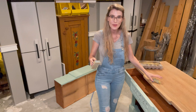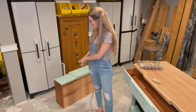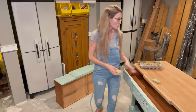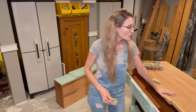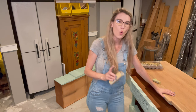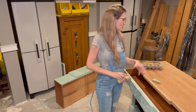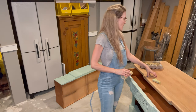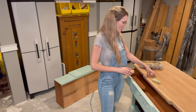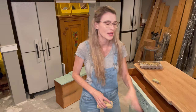I'm going to put the distressing on a time-lapse. I've sanded the top and it looks awesome — I'm going to put a white water-based stain and then some liming wax on there. We've got oak wood here and oak has great wood grain in it. I really want to highlight that grain on the top.